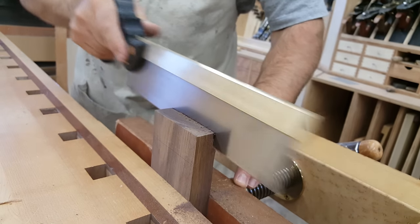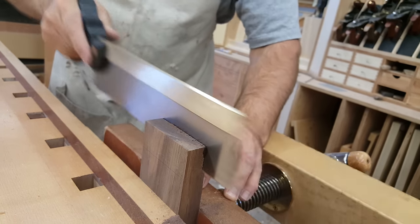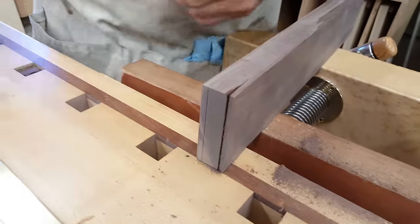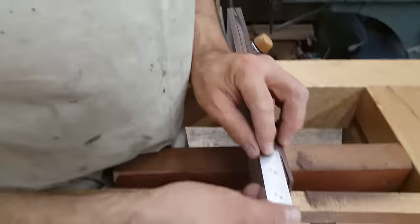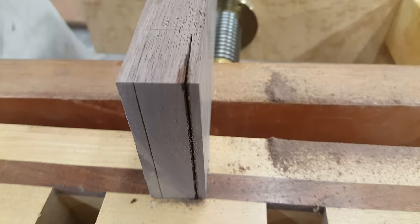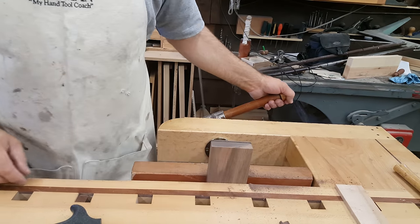What you want is a nice straight cut, and I'll show you what I mean by straight. Look at this side — it's a little bit cleaner, there's oil on the saw — but the cut itself has to be nice and straight. So if we were to put a straight edge up against that, no wandering one side or the other — a nice straight cut. That's your best bet: being able to get a cut that will go into a tenon, a tenon that will go into a mortise without having to be addressed after the fact.